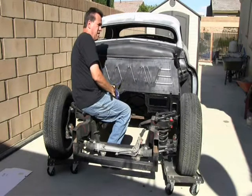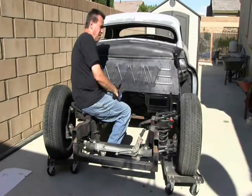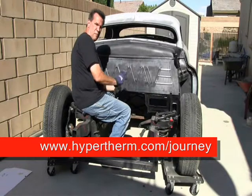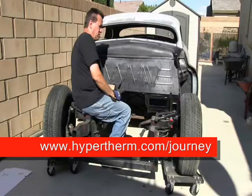This will give you kind of an idea of how advantageous it is to have the plasma. Sure, you can cut this out with a bandsaw or a sawzall. If you have a giant shear, you can do that too, but the plasma made very quick work of this for me. And I made this out of 16 gauge to keep it much stronger and stiffer, so when I mount things on it, I know it's not going to move.